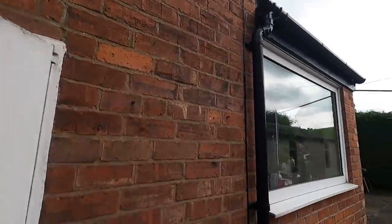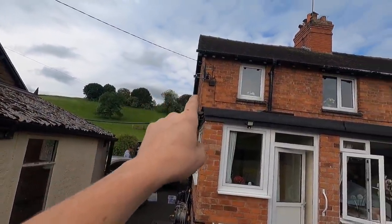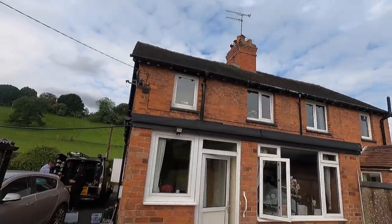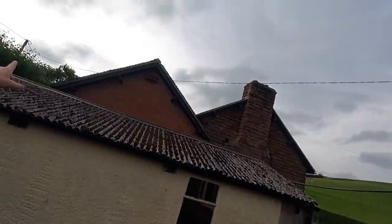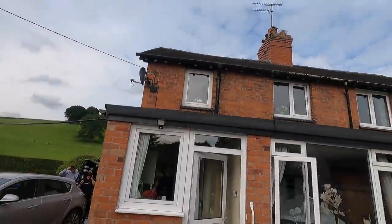There's our incoming supply coming all around. Also, because they're having an extension, the back of the house is all being dropped. You can see you've got the joint and the feed going across to next door as well with the overhead line. Our area's DNO is Western Power. My opinion is we need to contact them and they'll come out and hopefully reroute it - whether they go high level or do a new run in from the pole, which is absolutely miles away.